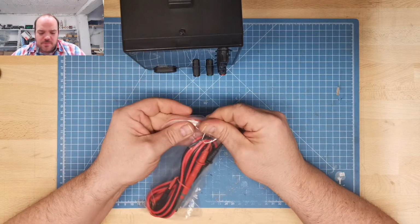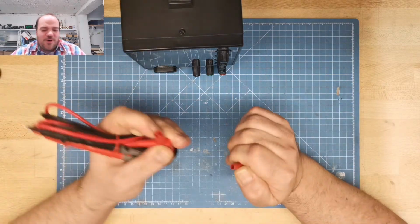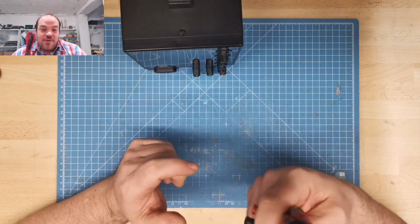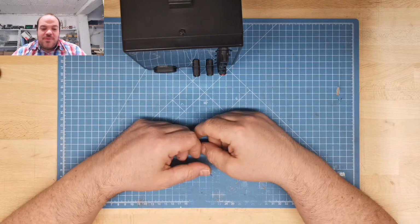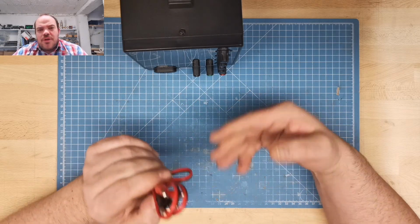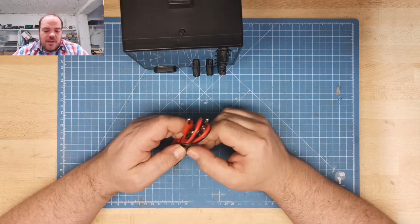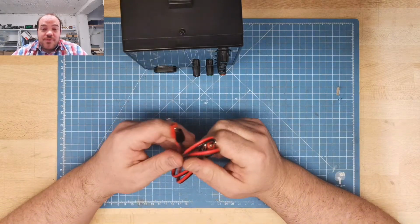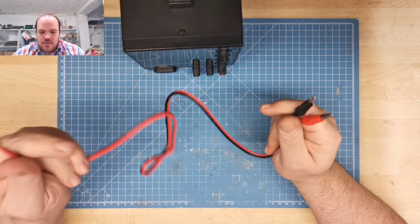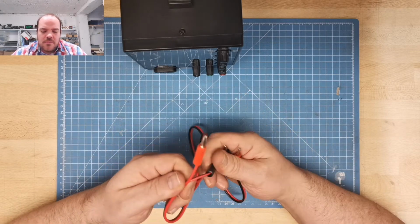Then someone has to explain to me why they deliver multimeter test leads. Okay. I think something went horribly wrong. You cannot stick this in, but hey, nice leads for multimeters, and I already have an idea what we can check. How we can check this and this at the same time and see what happened. Bad ideas. In another video I explain how to check the quality of a multimeter test lead without disassembling it, without cutting it open to see how thick the wire is inside. Just making a short circuit and measuring the voltage that drops over the cable. I think we can do this. I have a lot of multimeters beside me, and well, the cables I built are much better. So let's see how it looks.